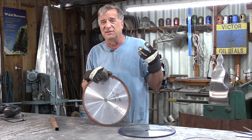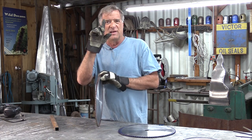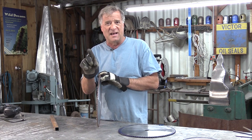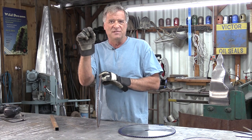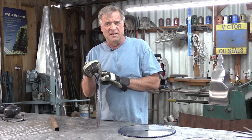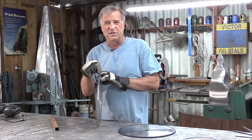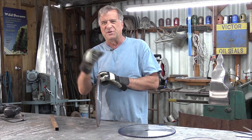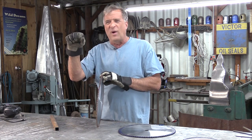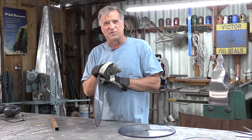They last a heck of a lot longer than those abrasive blades, and all you get is chips — you don't get the dust, so you're not coming out looking like you're working a coal mine. Now I need to emphasize: you cannot take an abrasive chop saw that runs the abrasive blade and put a tooth blade on it. They turn at a different speed — you're just going to burn up the tooth blade trying to force it down through the metal.